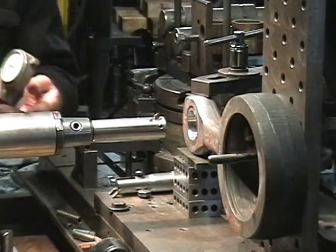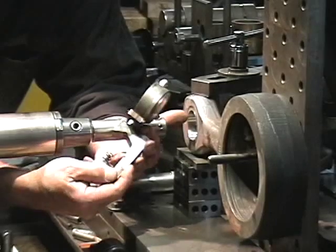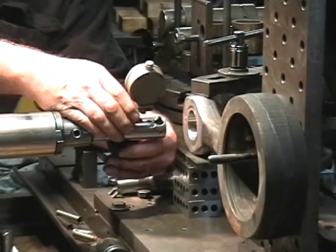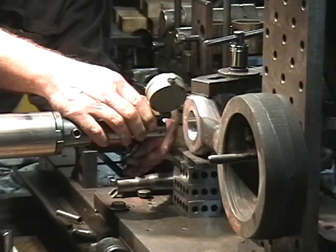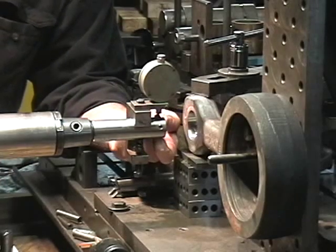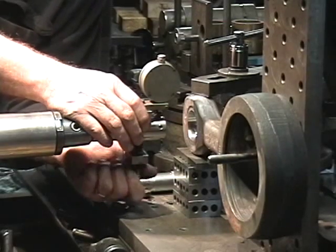I have a bit of a different solution for these bars on the boring mill. I've built a gauge — it is a tenth setting gauge. It's got a flat anvil and it's a C frame. To use this gauge, you just clamp it over the bar — it's got a spring and a locking screw. Find your high point and the center of your anvil. You unlock the tool and of course you've got an adjusting screw down in the bottom. With a tenth setting gauge, you can work to half a thousandth very easily.